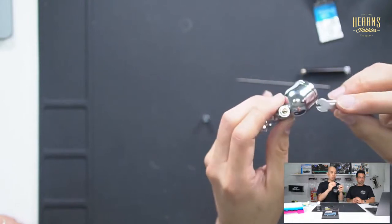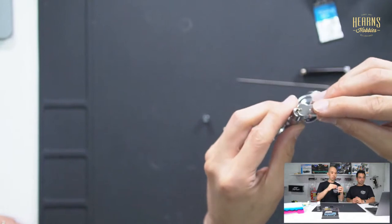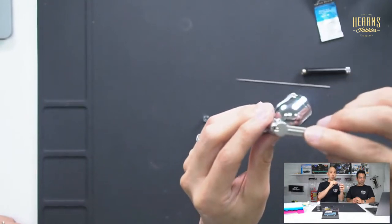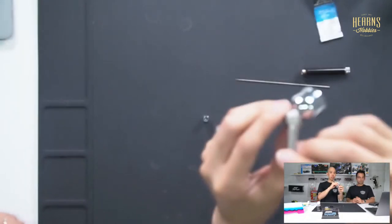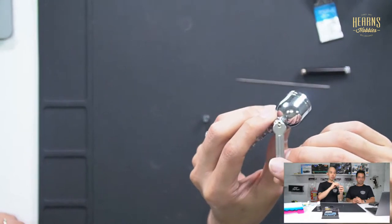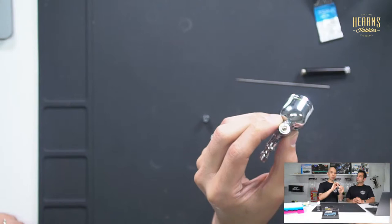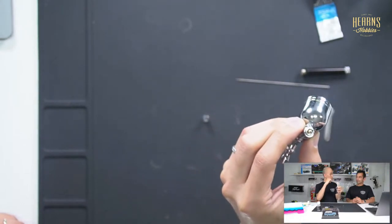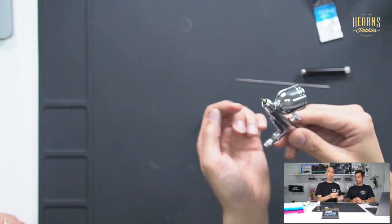And then this is a really important step too. So when you tighten it up, let me just get this aligned with the flats. Now you want to feel it, so you're moving it really gently with hardly any force. So I'm just barely pushing it, and you'll feel the point where you get the most resistance. And at the point of most resistance, you probably just nip it up like this, and that's it. Now if we went any further, it will tear all the threads off. That's pretty much it to getting it back on.